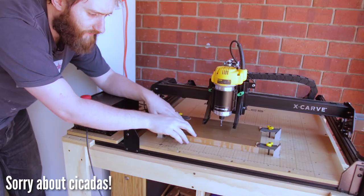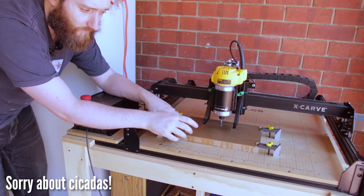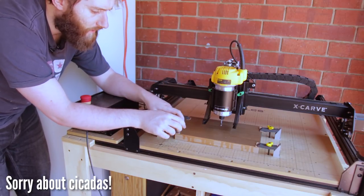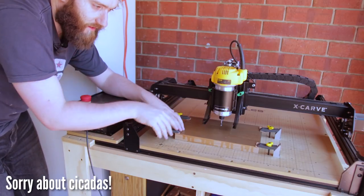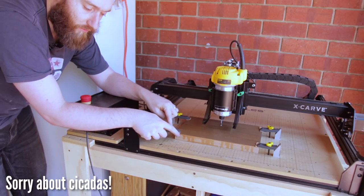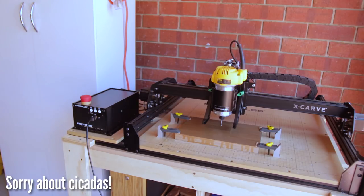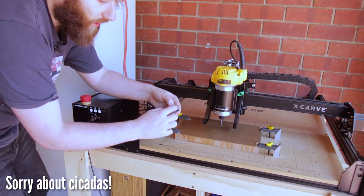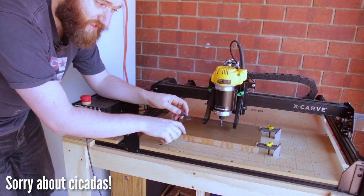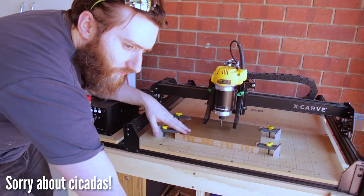I've got the art piece loaded into the CNC. This piece will be a little bit wider than the carving so it needs to be trimmed out on the table saw later — not a big deal, but that's why there's so much extra material and why the clamps are where they are. The clamps have a piece of cork underneath. If you use the Inventables clamps, they're hollow on the underside — I believe they're 3D printed — and that hollow part can pinch a little bit on the vinyl mask and cause it to lift up. So the cork solves that problem.